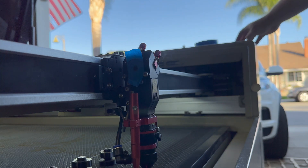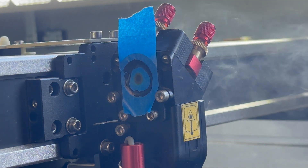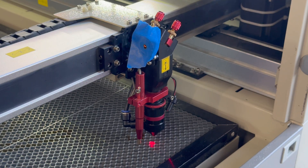Don't rush — take your time, double check, and even triple check before moving on. Sometimes I even find it helpful to draw a circle around the mirror opening to help me see exactly where the beam is hitting. Once those marks overlap cleanly from left to right, you know your beam is traveling straight across the x-axis. I also like to do one more verification pass — making pulses at five different locations: top left, bottom left, center, top right, and lower right — to ensure pulses are overlapping and centered at each position. If you see any discrepancies, go back and make the necessary adjustments before moving on.